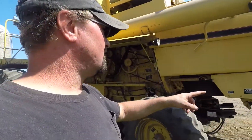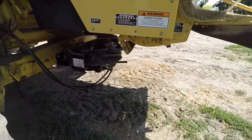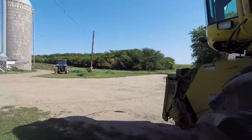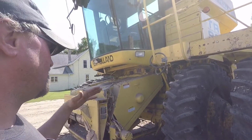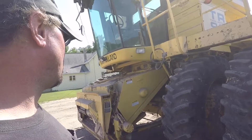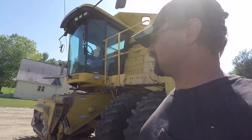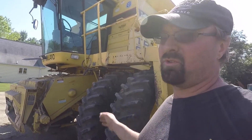Obviously, I don't know — these things here, you've got to switch these pulleys back here, and this thing's got to be moved up, the knives, the drum. Anybody that's familiar with these TR-98s, or these TR combines of this age group — TR-99, 98, 97 — these things have these stone ejection rolls in there. Sometimes I think about leaving it up, but if you ever run a rock in the rotor and it dings around and causes a fire... I don't know. Maybe it was a bad design for New Holland.